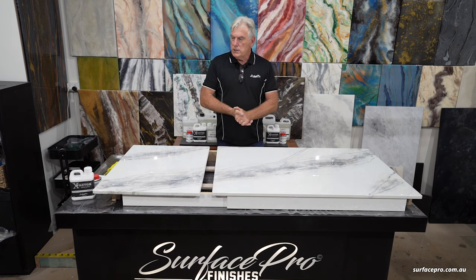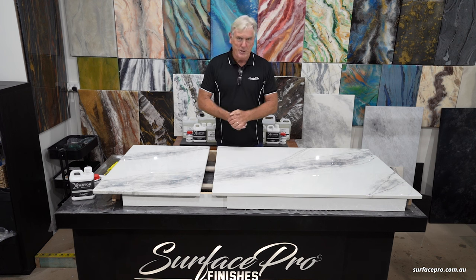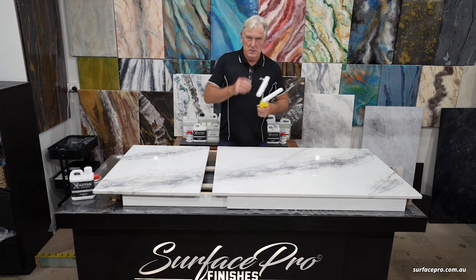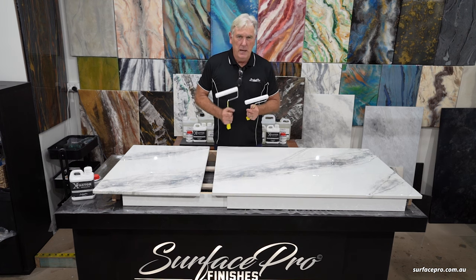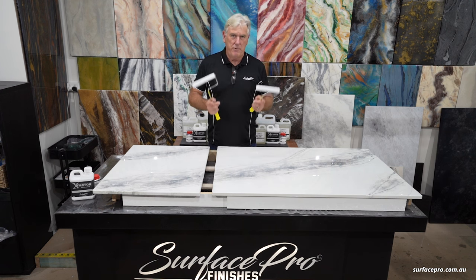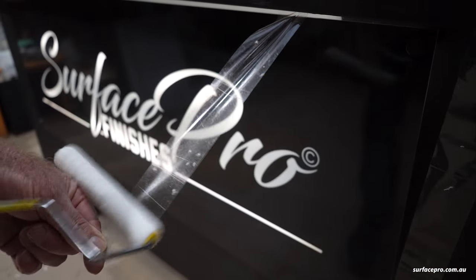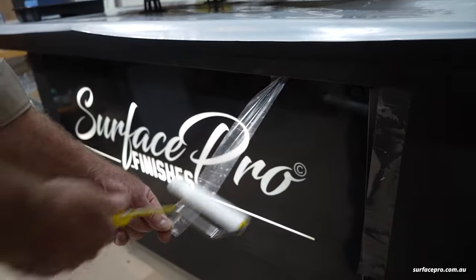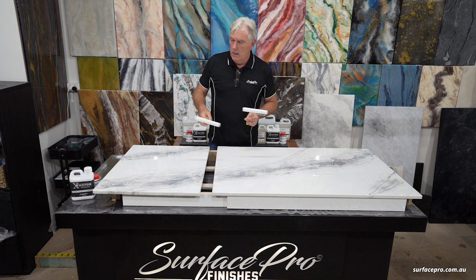Now, in preparation for rolling the X-Factor out, I just want to go over a couple of things with you. For a job this size, you need two rollers, a dry roller and a wet roller. If you're doing a kitchen countertop, you possibly might need two dry rollers, so you'll have three in total. I've already de-linted these. They've been rubbed up against some sticky tape to remove any of the dust, lint and fiber that may want to come out. I want it to come out on the sticky tape, not on my tabletop.